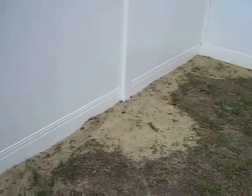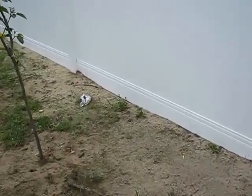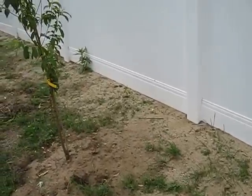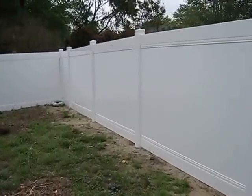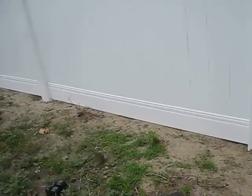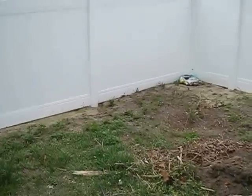I recommend you try to contour with the ground. The good thing about vinyl is if you have to sit it right on the grass it's okay — it's not going to rot. Just don't let it sit on the grass to the point where it's popping your post up. There's always an implied sag with vinyl: as time progresses and the sun heats it up, it will bow toward the center in a downward position. So if you're actually on the ground, you're benefiting because it keeps your panels from falling.